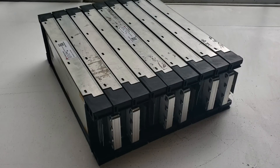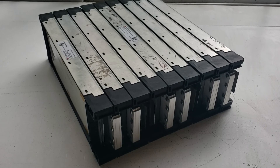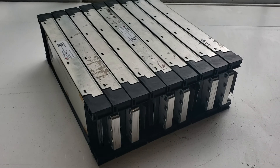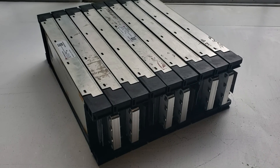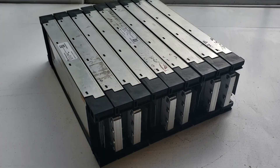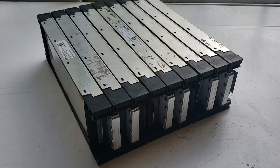There is one issue I'm having while building these battery packs: the motorcycle system will be pulling well over 100 amps, whereas my entire battery pack is built at 60 amp hours, which is well over a 1C discharge rate — and that's not what you want in a lithium-ion pack. The hotter these battery packs get, the worse the degradation becomes. These battery packs cannot exceed 86 degrees Fahrenheit, and once it starts getting into 100 degrees Fahrenheit the lifespan of the battery starts to decrease substantially.